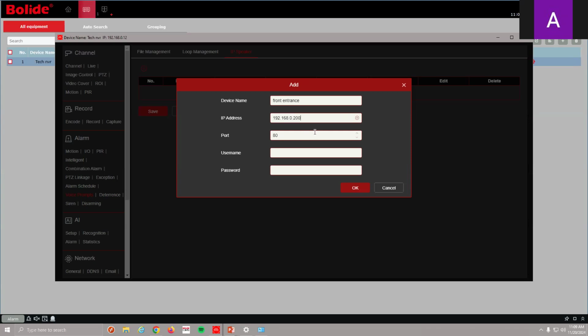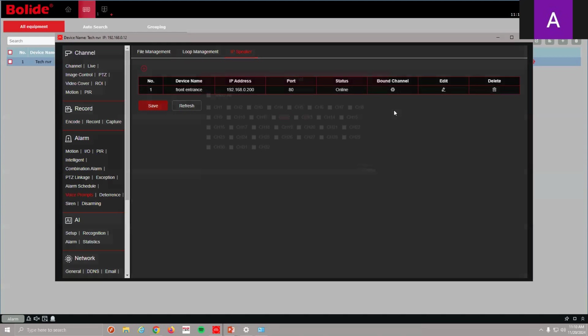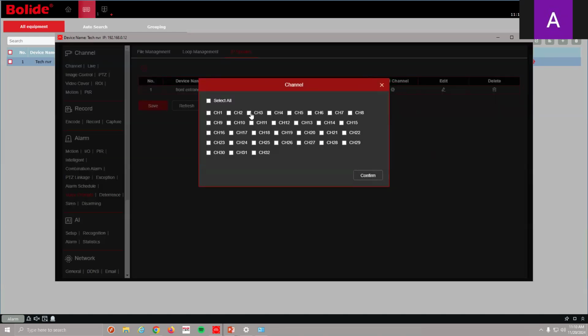We already know that my IP address that I just changed is 192.168.0.200. Port is 80 because that's usually the ONVIF port. The username is admin, and the password is TM1234. Okay. You'll see that it's already added. It already shows online. Make sure I save that. Now, once I add it here, I need to bind it to a camera. So I hit my channels that I want to bind it to. I have two cameras out there, but I'm going to bind it to channel three.